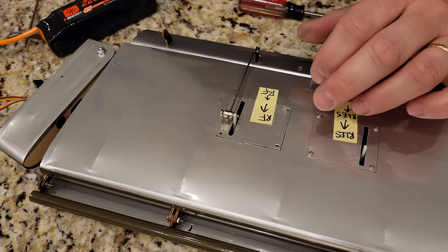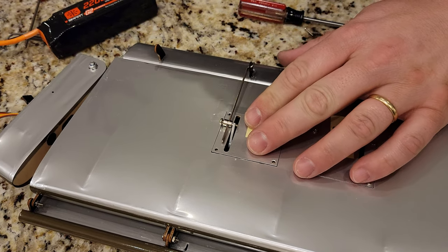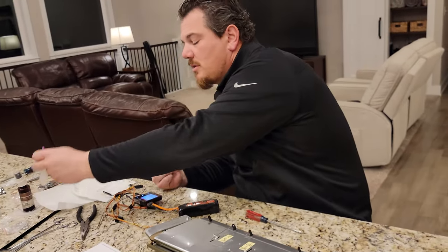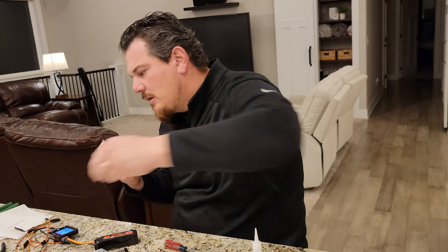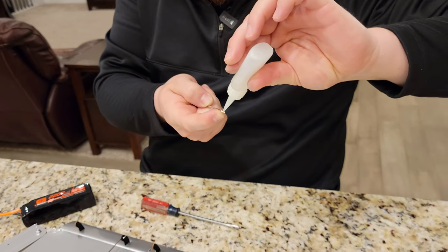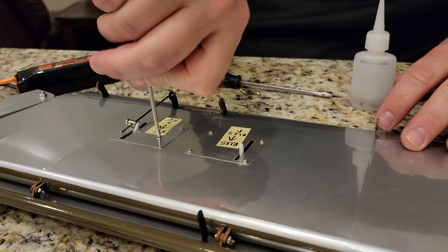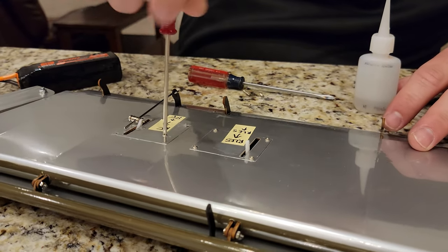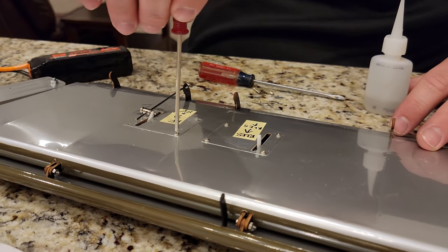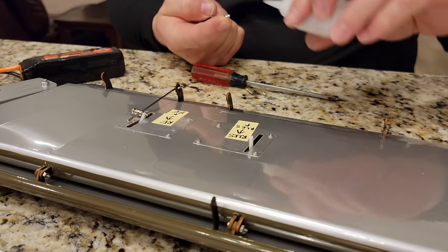Okay, cool. So now I'm going to walk this back to that position. I can go ahead and get the screws put back in. Now, since I pulled this out, unfortunately, I kind of need the glue so that the threads don't get stripped too bad. So I'm just doing a little teeny bit. Again, we're not trying to glue this together. We're just trying to line the hole. And that way they'll hopefully be strong, because we've gone in and out now twice, and that's a pretty light duty pocket that's receiving that screw.